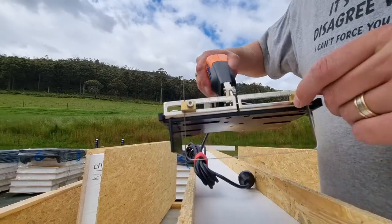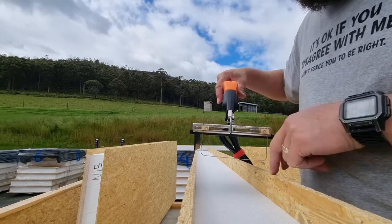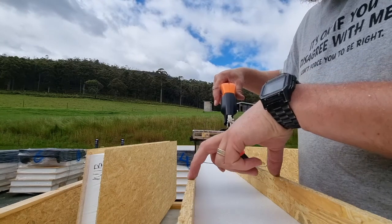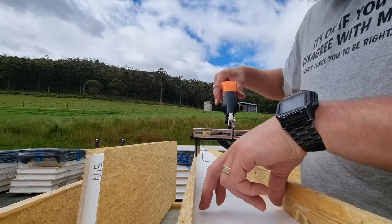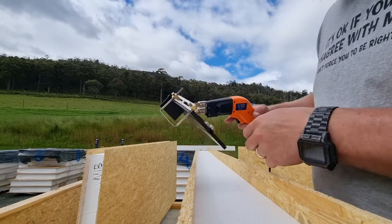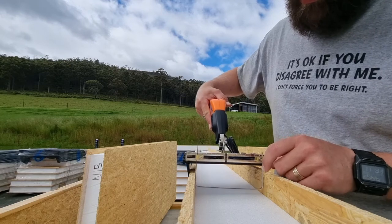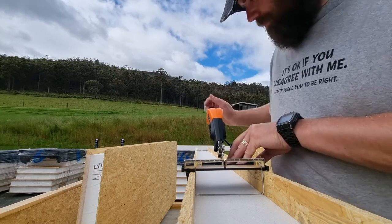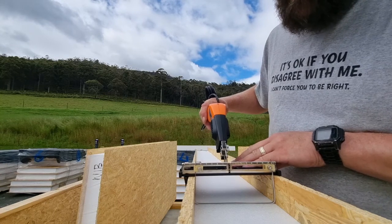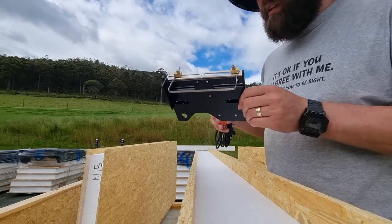So we've got this trick little cutter here for taking out more polystyrene. We've found one board where the gap between the polystyrene and the edge of the board is too little, which means the polystyrene is going to hold it up off the baseboard so that the OSB won't actually hold any weight — it'll all be on the foam. So essentially we need to cut the foam down deeper and they've sent us this little hot knife. It comes with a couple of blades and this blade came straight and I've just bent it into shape to suit the shape of a board that does have the proper gap. So we just need to plug it in, work out which power setting we need and then hopefully it'll just slice through the polystyrene — it should be sort of smoke free. Hopefully I don't electrocute myself or burn myself or burn a panel down. That'd be advantageous.